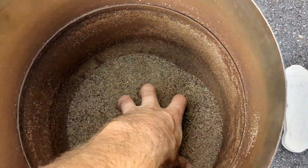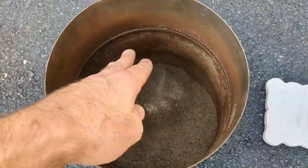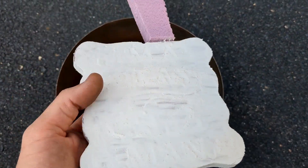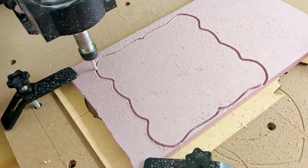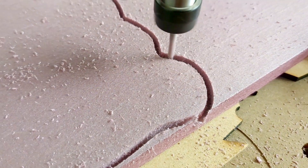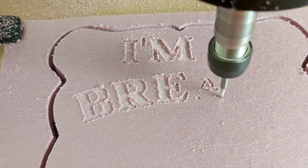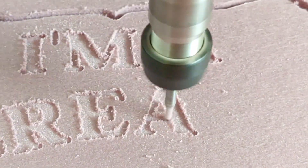I'm going to ram this sand up outside today using very, very dry sand. You can see it here, and this is going to be the lost foam cast that I'm making. I've carved out a pattern using my CNC machine. I made the pattern using a program called Inkscape — it's a free program you can get off the internet. I then loaded it into my software so the CNC could carve it out of the foam.